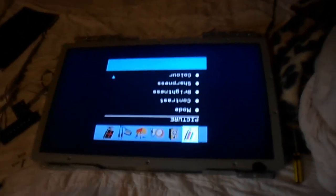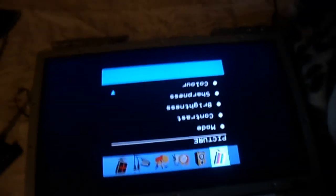Only time will tell how this repair will go. Some people seem to have more success using thermal padding - I didn't have any of that material available. So I've assembled everything - this is the panel module with all the boards on top of it, and it's quite a nice design because you can test it like this with the front plastic frame outside the TV. All you do is lift the panel, line it up, and put it inside the frame - just make sure you don't damage the LCD panel you just fixed.